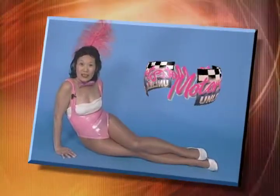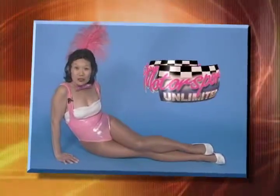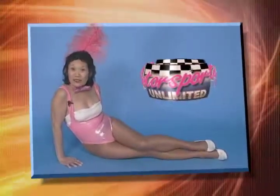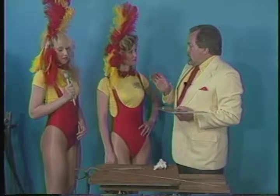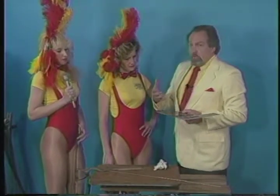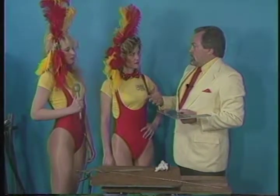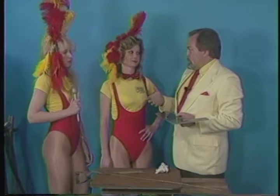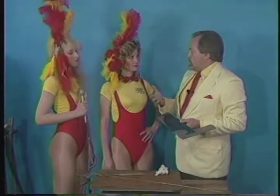In any event, the TIG welding process was called heliarc welding because in the beginning, the inert gas used was helium, not argon, thus heliarc. Welding aluminum has always been a problem, and when we got involved with World War II, it became very obvious that it was going to be a serious problem because along comes the airplane, and there's all kinds of joints you want to weld on an airplane, and the airplane's got to be aluminum, so now it took some major effort as to how the heck can we weld this stuff.